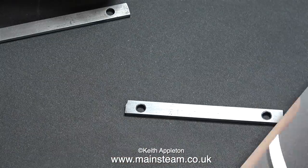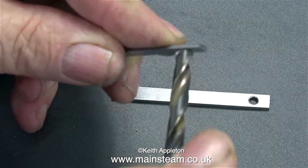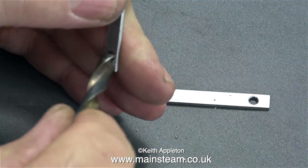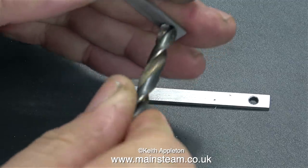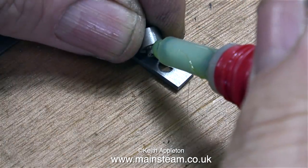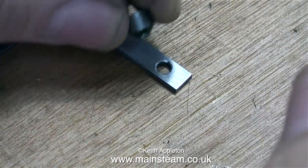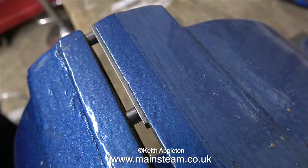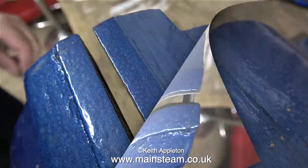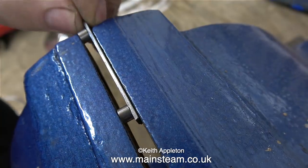A couple of things to do to the pieces of flat bar: first of all clean them up on some wet or dry sandpaper, and countersink the holes at one side very slightly using a twist drill. Not only will this allow the small parts to fit perfectly against the pieces of flat bar, it will give a bit of a reservoir for some extra Loctite. I'm using Loctite 603 here, and from my experience this is a better method than silver soldering the bars. Once I'd applied the Loctite to both of the small barrels and fitted them to the bar, I temporarily fitted them into my vise and applied some pressure to hold them together until the Loctite had set.